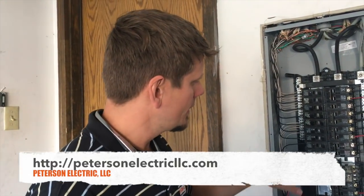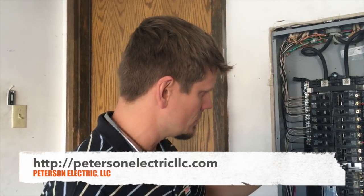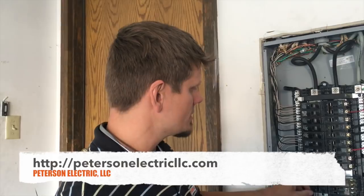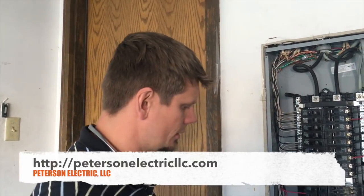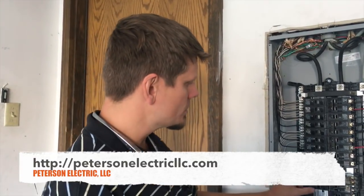Bottom line, this disconnect is within sight. If the guy accidentally turns the breaker on when he's working on it, he shouldn't be an electrician — neither should he be a homeowner touching it. So the point is that if you pull away because you had to answer the phone and you came back and someone turned the breaker on you, you're going to get shocked. So maybe we should have it lockable.